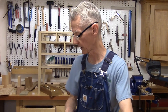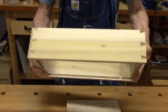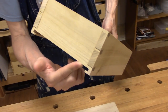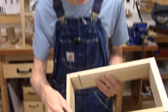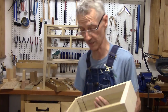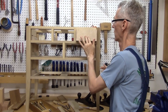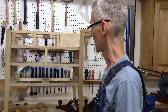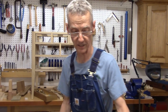We had a little bit of a delay getting to this point, and while we were waiting to find time to shoot this I made another drawer — and here it is. This one is glued together and has been planed flush. The back is cut the way it's supposed to be, and I will explain next time about these mystery dados. Let's fit it into its space. It goes pretty nicely — a little snug right here, but that's how I like it at this point; I'll fine-tune it at the very end. So we're coming along — when we get back we'll be working on these drawers. Thanks for stopping by and see you next time.